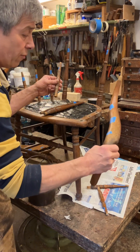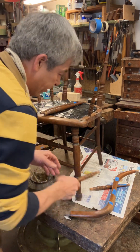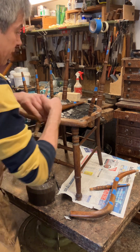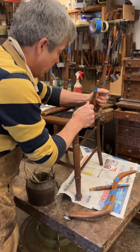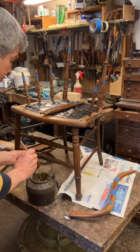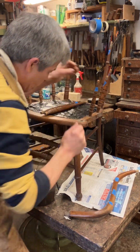Where's number four? That's an X, so that was at the front. I think somebody's done this in the wrong way before actually, but it's very clear how they go. This glue I'm using is an old animal glue and it's hot when you put it on, so you have to work fairly quickly. That's why I'm going to do all the spindles into the chair first, and then put the arms on when these are in.